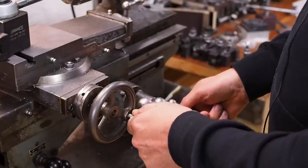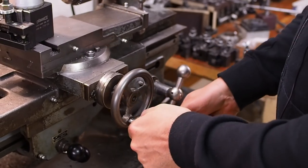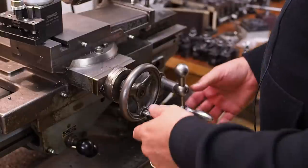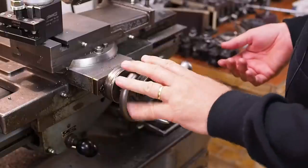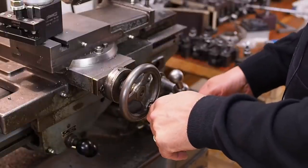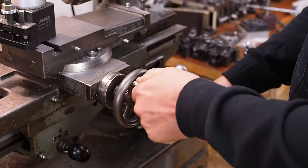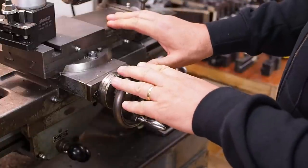Highly theoretically, because if you look at it, there's always some sort of jerkiness in this motion. One hand's always a little slower than the other, or a little faster. And that's super easy. That was just one to one. Imagine if this was 40 taper and we had to go, let's say, three rotations of the cross slide for one rotation of the saddle. You know, this is where we're getting into, okay, for every 120, we need to have done a whole revolution. Whoop, too fast.